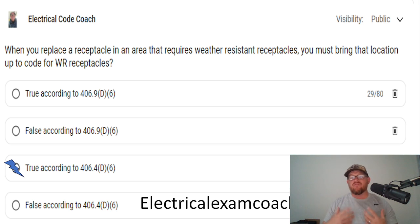Now, this is very important for us to understand as installers and inspectors: replacing a receptacle with a $0.50 receptacle and doing a $50 service charge — those days are over. If you're in an area that requires AFCI, GFCI, tamper resistant, or weather resistant, you have to bring it up to code. This also includes using in-use covers or whatever appropriate cover is needed to cover the device.